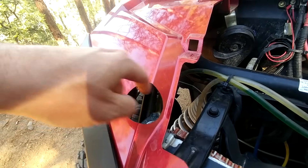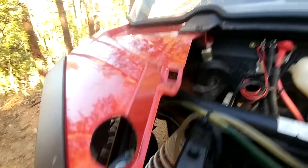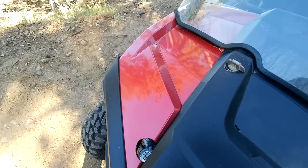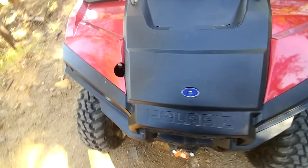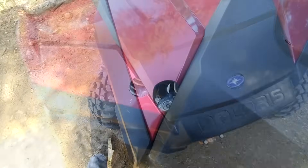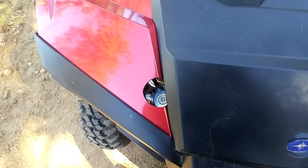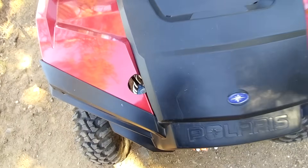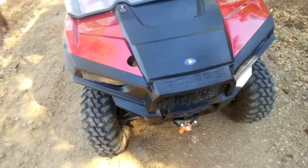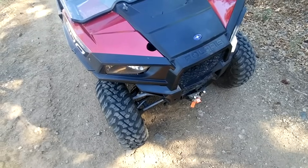I was going to plug it, but I don't really care — when the cover's on, it doesn't look that bad; it's a little bit of venting. My recommendation would be to carry a spare radiator cap, because once that cap loses pressure the machine will overheat and will continue to overheat. I also changed the thermostat and the water pump at the same time while chasing that problem, though those turned out to be unnecessary.